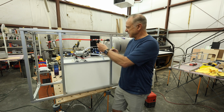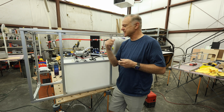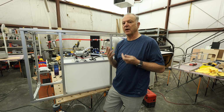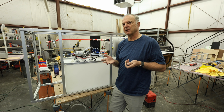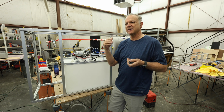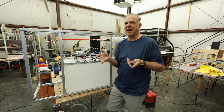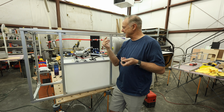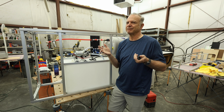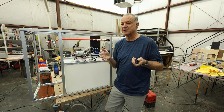Another thing about this water heater, so you just plug it in. We put a plug in just under the sink that this connects to, and it uses a lot less wattage or amperage than the Bosch water heaters. This pulls about 700 or 800 watts, so it's much lower, but because it's lower wattage and it's more water, it's 4 gallons where most people are using the 2.5 gallon Bosch water heaters. It does take longer to heat, about 25-30 minutes, where I found the Bosch water heaters take about 15 minutes to heat the water.